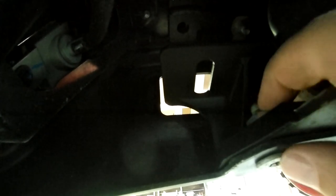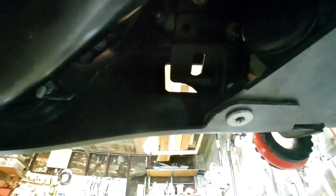There's a little bit of interference so I didn't put in a washer since this nut has a flat bottom — the fit is really really close. I have concerns about over-torquing a 3D printed part, so I didn't overdo it. Also, I couldn't find an actual 10mm lock washer — I grabbed a 3/8 inch but it's a little too small, so I'm going to skip it for now and see how it holds up. Overall it's in place in a really good position, so we'll try to install the light.